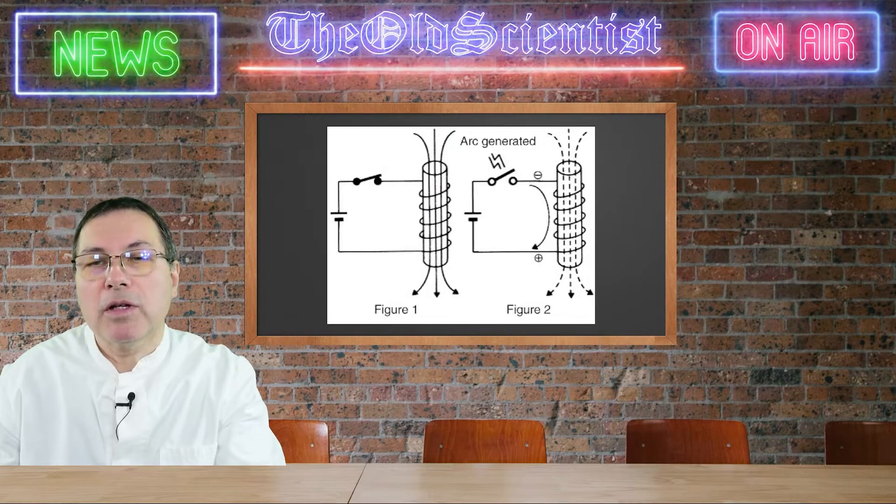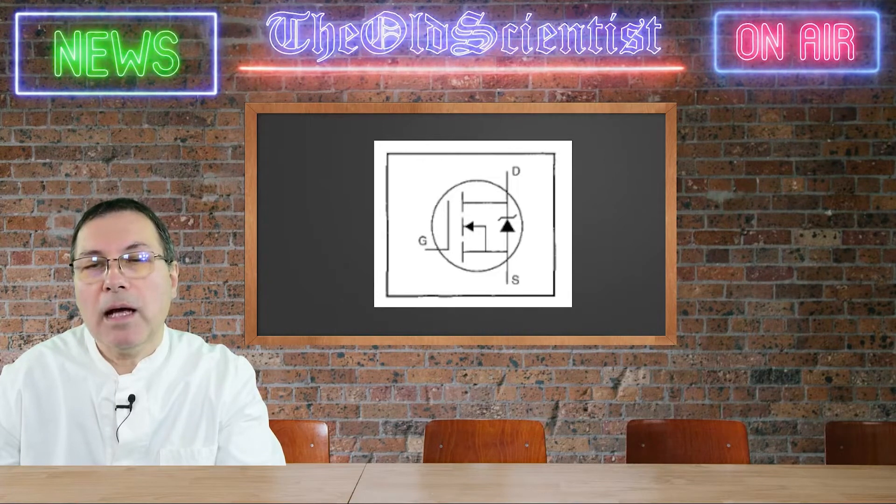With Bedini's school girl circuit we use the back EMF to drive a load, however we might not dissipate all the energy and risk destroying our amplifier. The industry has implemented in MOSFETs so-called body diodes — they do however not exist in transistors. It is symbolized as a Zener diode and will allow current to flow when the voltage is exceeding the rated voltage of the MOSFET.